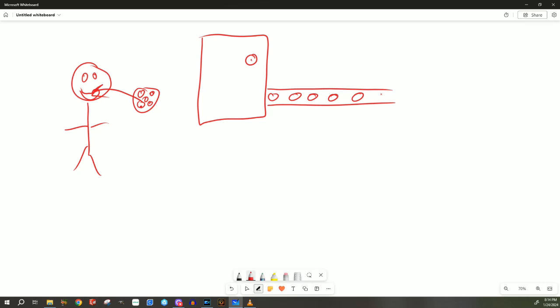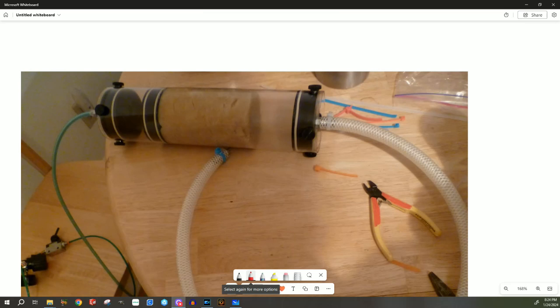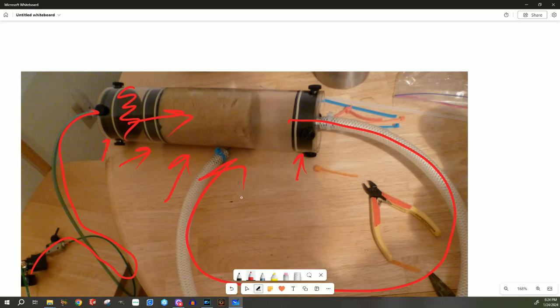So how are we going to do that? Well, first step is we need something to spit out those chocolate chips onto the conveyor — just like that. This isn't the first time I've tried to do this. Here you can see I've got a big cylinder with some cookie dough in it. This is a special sugar cookie blend I came up with that was going to extrude pretty easily. I had two sealed pistons with O-rings, and then you would pressurize this area with this line and it would push the dough out through this tube — all in an effort to get a CNC cookie dough extruder that would print out your name in cookie dough.